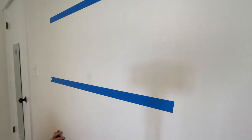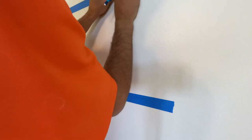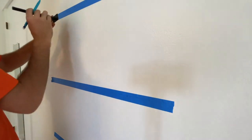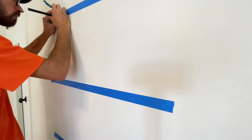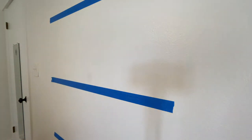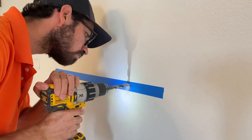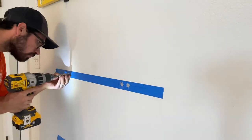It's a lot easier for me to manipulate the shelf holes than to try and manipulate where the bracket is located on the wall. I was able to keep the spacing between all my shelf brackets exactly the same, so my shelves ended up being interchangeable between all three locations. But depending on how accurately you install the brackets, each shelf may not fit at any given spot.